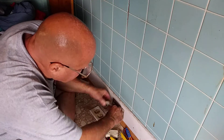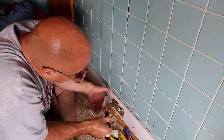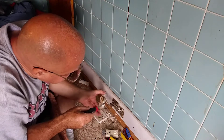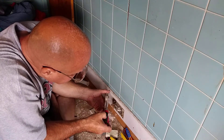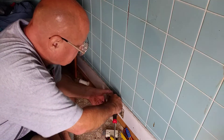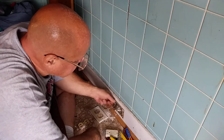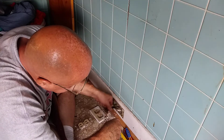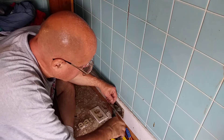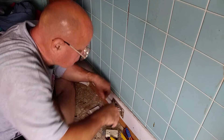The white is on the silver side, so we'll take that off. This is the black wire, which is the live, and it was put on the wrong side. The wider slot — it should be on the other side — and it's around the screw backwards again. Let's clean this wire up a little bit, get all these strands and all this cloth off of here.